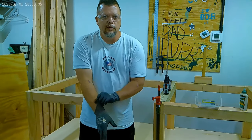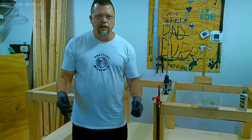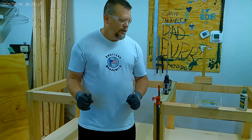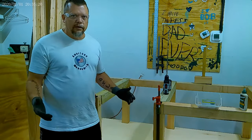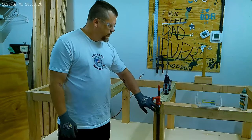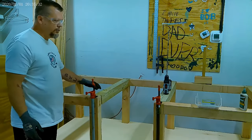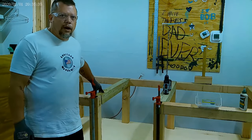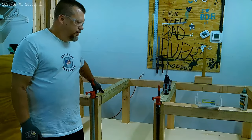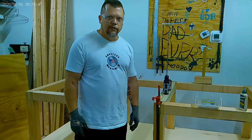I haven't talked real much on this video. I just wanted to show you how super labor intensive it is with all the hand cuts, the chiseling, the filing, the sanding, getting everything to fit together just right. And now we're to the point where the whole frame is completed. And what we're doing next is putting in our dowel pins to keep everything secure for the top portion of our tabletop. And then we can put our plywood in, cut our hole for our table saw, and keep moving. So at this point, I'm going to drill some holes, put our dowels in, and you can follow along if you like.